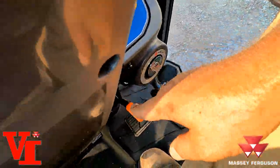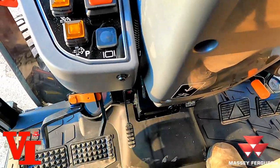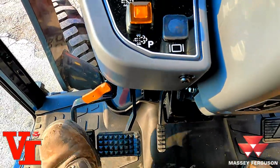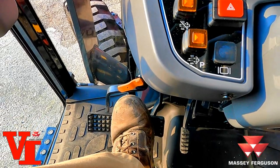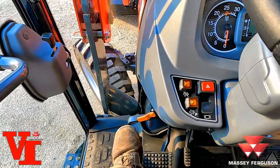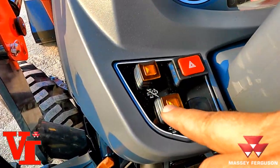The parking brake lever is here — push it down to engage and push the pedal to take it off. Here's a quick tip: if you hit both brakes you'll dump the oil to the hydrostat and it will stop. If you hold one brake you can build back pressure — we'll show you on a hill how to keep it from wanting to roll forward. These two buttons are your DPF controls.